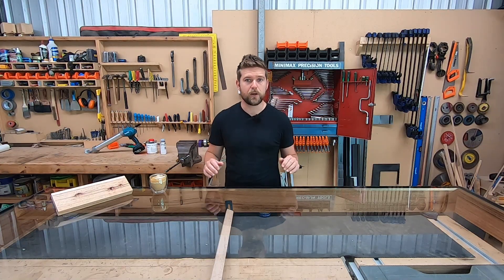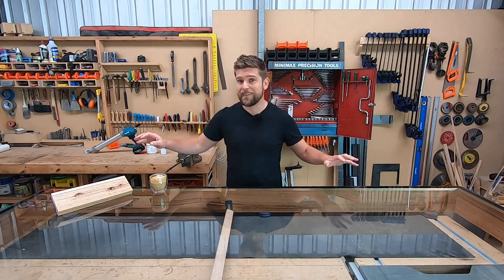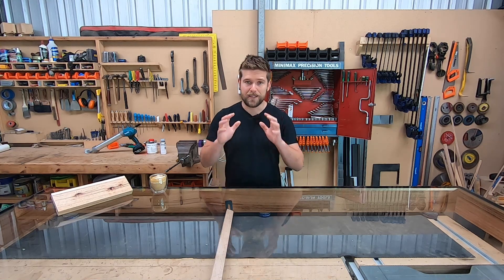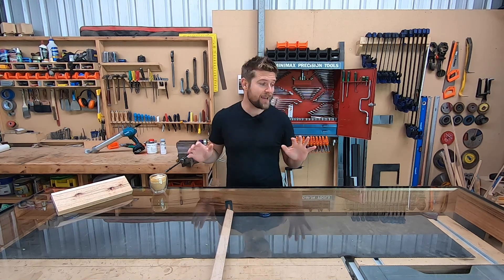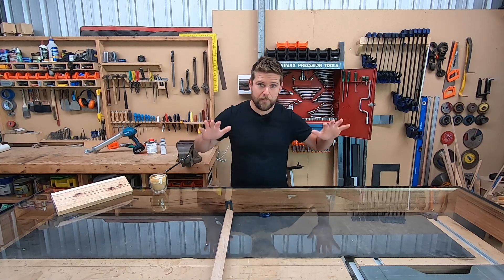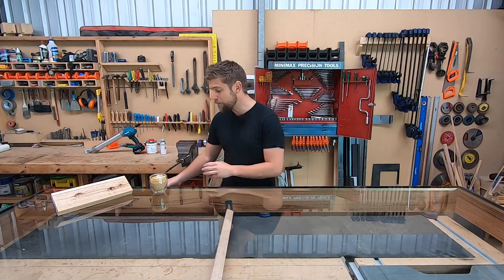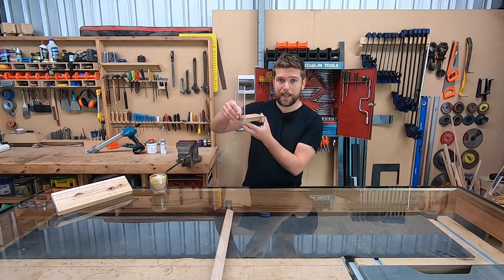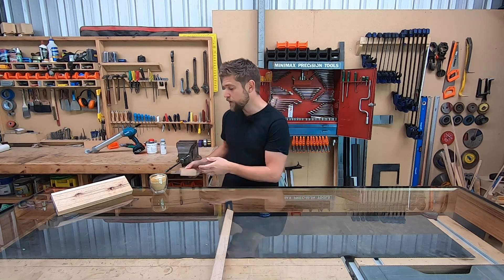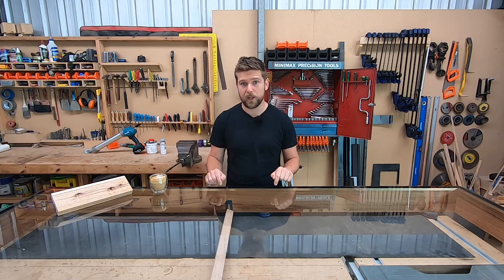Coming up with an adhesive system for these windows turned out to be kind of challenging. There are a couple of reasons for that. The first was how I was sticking the glass to the windows. I really wanted to use natural hardwood for my windows, but I didn't want them exposed to the elements - I just didn't want the hassle of maintaining timber on the outside. That meant sticking the glass on the outside of the timber, which means the glass is unsupported. That's a problem because it meant I ended up with an unsupported lap shear joint where the adhesive is the only thing holding the glass on. It's critical that somehow I can make sure this adhesive is going to be strong enough.